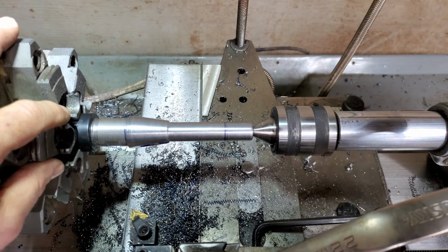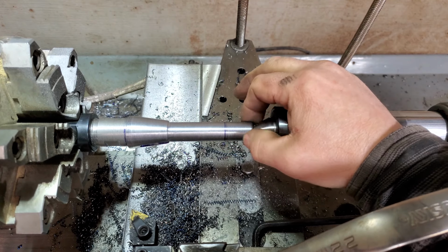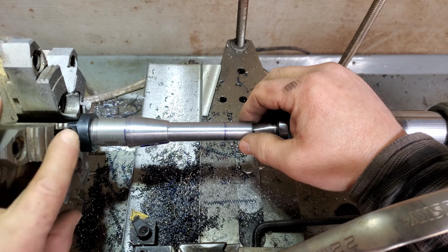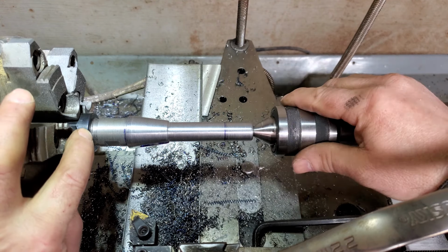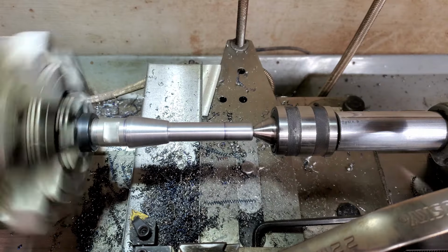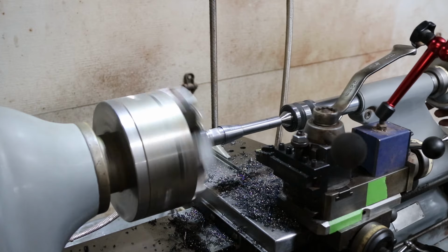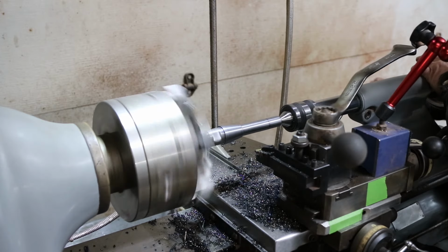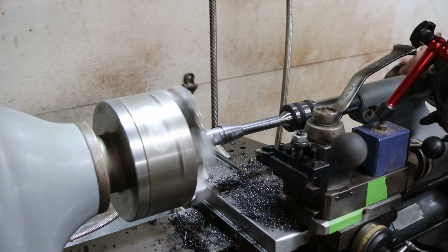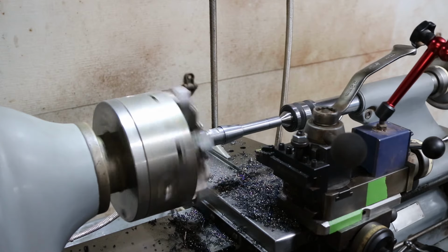There's no good way to hold this, to put that 5/16-24 thread inside of here, so I got it clamped on the nut and put a center in there, turn it on low. Hopefully to help line it up. Like I said before, that one's not critical, and I think that'll be fine. It might wiggle a little bit, but it should be all right.